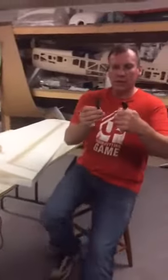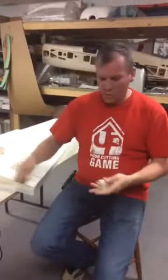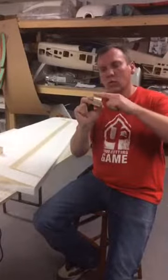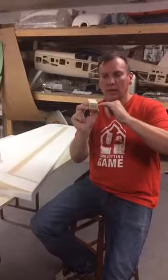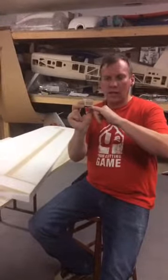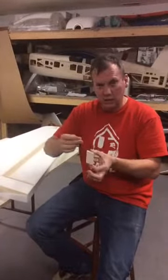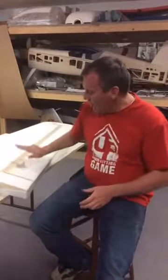He's made a bunch of different series for me. Now, you're going to notice that I have really big bottom pieces. Now, this is the reason why. I'm going to embed this into the foam, and the reason that this is a 1/4 inch piece of balsa up here, an 1/8 inch piece of light ply, a 5/8 piece of balsa, and a piece of light ply down below. I do not have these drilled for where these are going to go. I embed this, I bevel that off perfectly, then I sheet the wing.